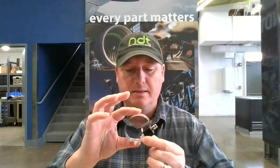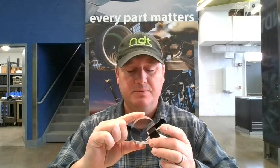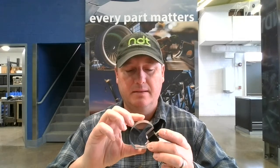So the first step really is to remove the transducer, which is this portion here, and just guarantee that the coupling between the transducer and the wedge itself is adequate to remove the air. And the coupling between here can dry out. If it's been in the toolbox for some time, it's definitely something that you want to check. At minimum, I would say that we want to check this a few times in the morning and at different times throughout the day.